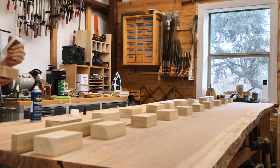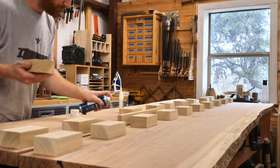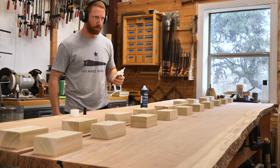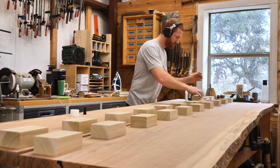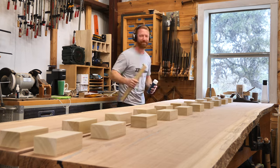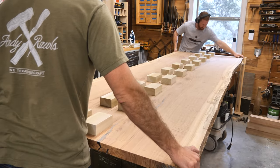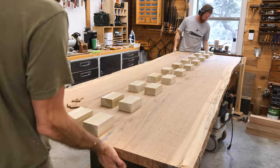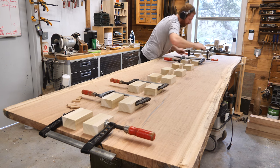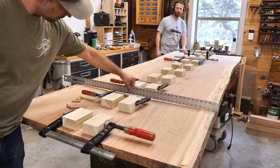It's pretty darn good. So once we get that joint dialed in, we have to tackle the clamping situation. Robert came up with this idea — he's taking CA glue and gluing these blocks down. They're eight-quarter poplar, and then we're going to use those as clamping cauls with the hand clamps. The downside is all your clamping pressure is on one side. We have dominoes in this — it's really important that you get some kind of domino or biscuits in these to help level the joints. It's not going to add any strength, but it's going to help keep the joint level and make your glue-up go way better. So as we start getting these clamps on, all the pressure is on one side of the table, and it's naturally going to want to make it bow.